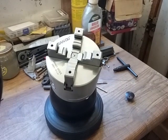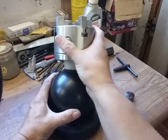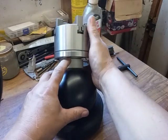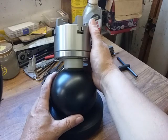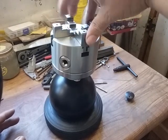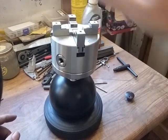So that's the version of the hand engraver's vice, and it's got some distance left between the chuck and the thing there for when it wears in, which will take quite a few years, I would think. And you can turn it quite easily. Turns quite smoothly because the nylon 66 is a very good hard bearing wearing surface.